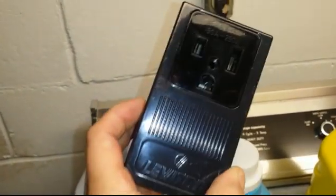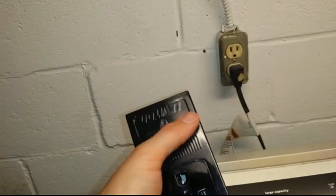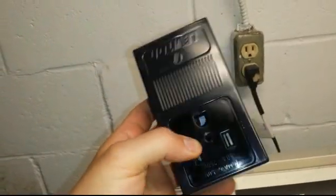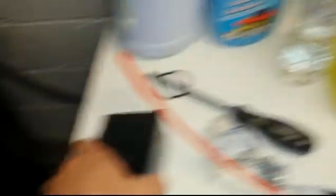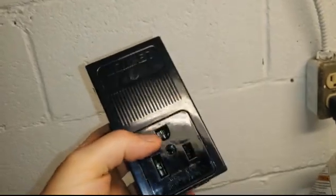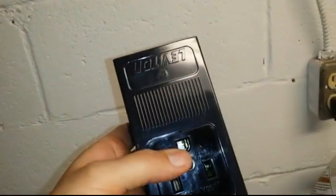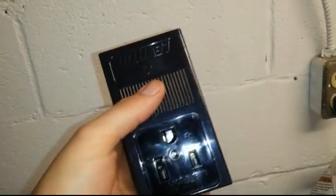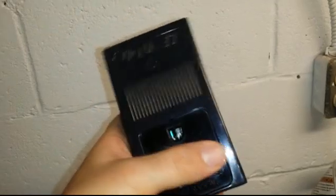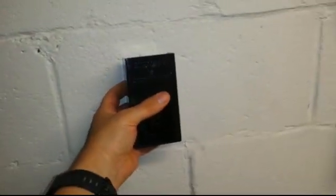Here's my box and I'm going to mount it. It gets mounted this way which bugs my OCD because they have the logo printed upside down. I think that's because codes changed at some point and the molds didn't. But whenever you install an outlet, the standard now is that the ground pin should be on top, so that if some kind of bit of metal falls down between the plug and the outlet, it's going to hit the ground first rather than going across the two powered terminals. The writing is upside down but this cord has the ground on top so that's going to look great.